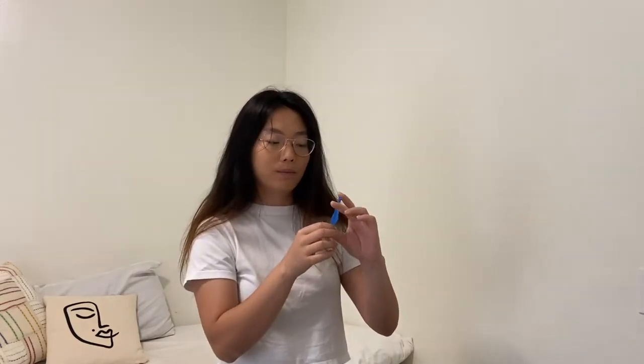We're going to use Alice as our frame of reference here. The reason I chose the laser cutter is because the figure of Alice is a relatively complex part, and the 3D printer does not necessarily do a great job at printing those parts. I also needed something precise that can work with a material that wouldn't change under water, so acrylic was a great choice. To print the Alice figure shown here, I just sketched it up in Illustrator and played around with the settings for the laser cutter to get this little figure.